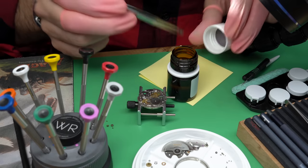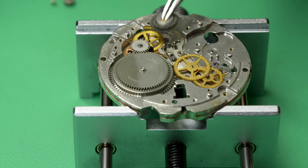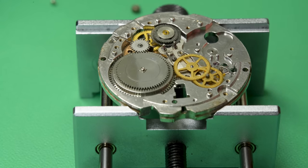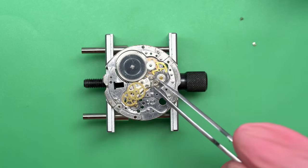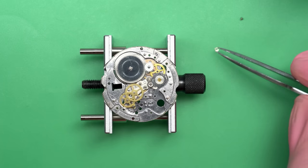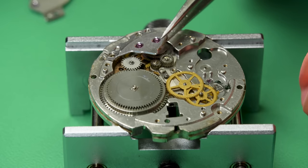I'm going to use a special lubricant/cleaner called Lubetta to clean this reversing wheel. These you can't take apart — I can't pry it in half to clean inside, and they require cleaning and lubrication, so that part can be a little bit tricky. What I like to do is use Lubetta, which is a cleaning agent that leaves behind a thin layer of lubrication rather than evaporating off completely. There are a couple of intermediate wheels, and this part including the reversing wheel is for the automatic winding works. This watch is an automatic — and a heavily dedicated one — meant to be worn every day so it will wind itself up.